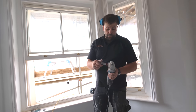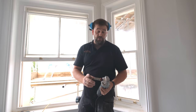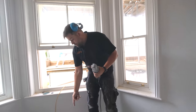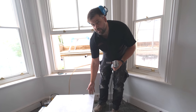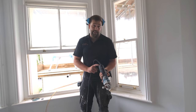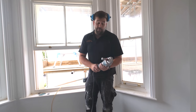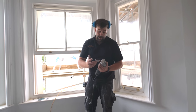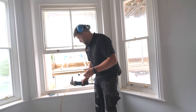When I cut these holes, generally, I like to use this little bit of kit. This is amazing, this is from a company called Tileroy. I get these from Trinity Tiles again across the road where we just got the tiles from. They supply all these little things. These are amazing. So when you're going around, I can take all these little burrs off. Rather than trying to use a tile file because it's porcelain, tile files don't really work very well on it. So you can put it onto your grinder. I like to run it at full whack, so that's 6,000 RPM. Some people slow them down. I think it's better if you're working at it at its full pace. So I always keep it on 6,000 RPM. Obviously, really, really careful with this. It's not anything to be messing around with. You can hurt yourself, obviously, using it. But for this, it's a great bit of kit. So I'll show you how it works.